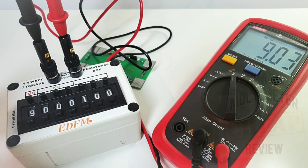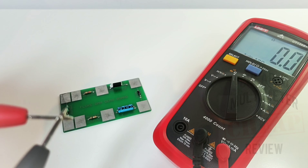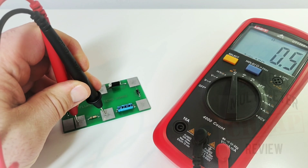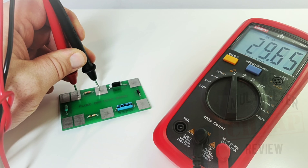Let's check the leads for resistance — nice and fast, already starting off on the low side. 0.5 ohm — spot on. And 22 megaohm reads as 23 megaohm.